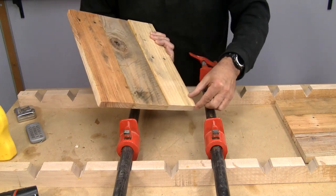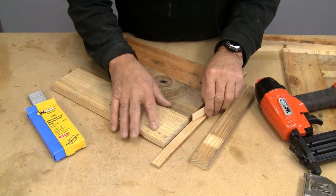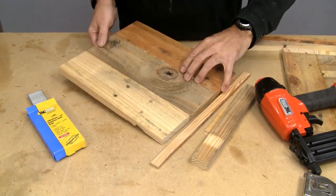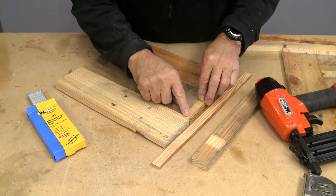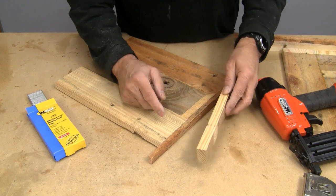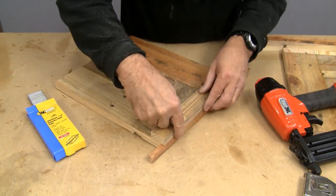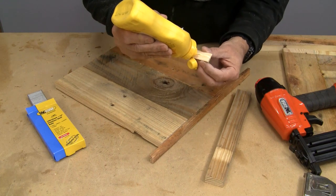The next part is to put a piece of wood across the bottom that's going to be both a foot and a bottom. Now here's my gable end — I've got a little flaw where there's an indentation, meaning this board is thinner on one side, but I really wanted to keep this knot in here, so I went ahead and used it. I've made a little spacer piece from a cutoff. I'm going to glue and air-nail this little piece on here so it will be both the bottom of our rack and the feet, because I want the feet to be lifted off.